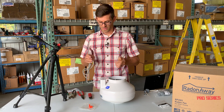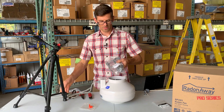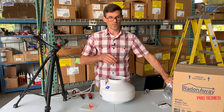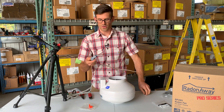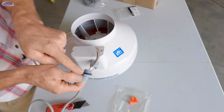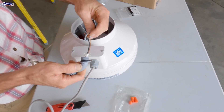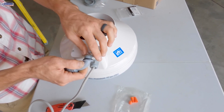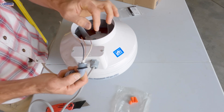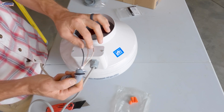And that's how you put a new power cord on your new radon fan. We'll also put a link to the power cord kit that does come with the bushing, if you want to replace your power cord, in the description below. And again, if you've got an outside system, this would be in conduit — you'd do pretty much the same thing, except make sure that washer's in good shape, thread this through the electrical box cover, tighten everything up, and then reconnect everything the same: white to white, black to black, and the bare copper is going to go to the green for the ground.